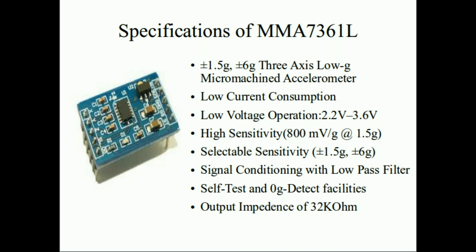Some applications of this accelerometer: they are used in 3D gaming for sensing tilt and motion, in PCs and hard disks for free-fall detection — whenever a PC or hard disk is falling, it jams the rotating part so that when it hits the ground it doesn't get damaged much. They are also used in cell phones for image stabilization and motion detecting, as an e-compass, in pedometers to count steps, in smart watches and smart bands, and in robotics applications.